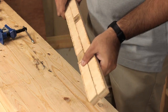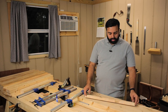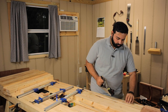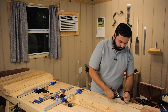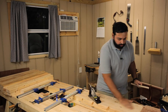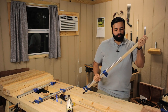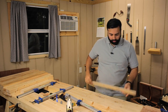What I've done is I've taken a sheet of plywood. I think this is just under an inch, and this seems to work out okay. The thickness needs to come down by a 16th because it is a little too tight in the middle, so I'm going to do that right now. That should do it. Shrink it down just a little bit in the size. Needs a little bit in the width here.